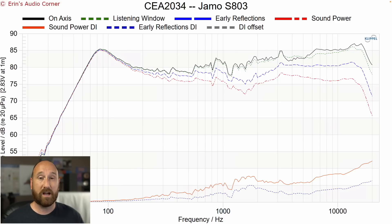There are different levels of accuracy, and certainly preference comes along. But the average sensitivity of this speaker is about 81 dB, so whatever the specs say, if it doesn't say 81 dB it's incorrect. Taking 81 dB as a median mid-range line from 300 Hz to 3 kHz, you can see the bass is about plus 5 dB around 80 to 100 Hz — there's that resonant, boomy character. And then above that in the high frequency you're about 5 dB above that median level. You know those cars that drop past you in traffic? That's this speaker in a nutshell.